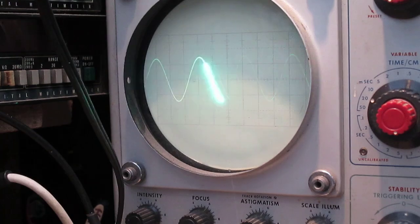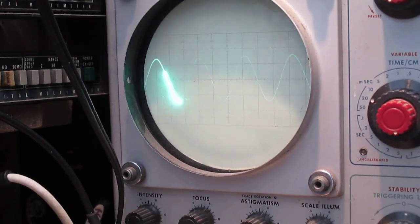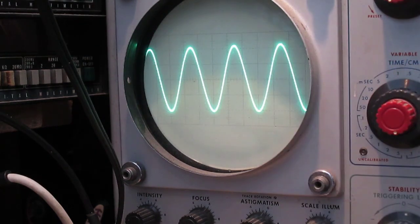That has fallen, not quite by half. So really this amplifier isn't very good in terms of frequency response. We were at 4.48 and it's fallen to 2.3 volts RMS. Frequency 20 kilohertz. And as you can see, that's fallen as well. That's far from our sort of center frequency in inverted commas at 1 kilohertz. So yeah, it's not a brilliant performing amplifier. I suspect though that this is why the owner likes the sound of it, because it's rich in harmonics and whatnot.